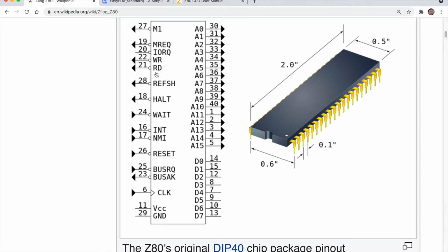So you can basically use these 4 lines here to control the memory and the I/O, so that the correct device is connected to the address bus and the data bus at the right time for the processor to access it. And that is super easy, as we'll hopefully see probably in the next video when we get into that. There are a few other control lines here.